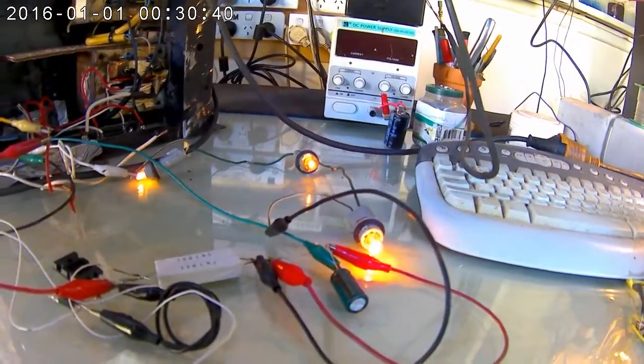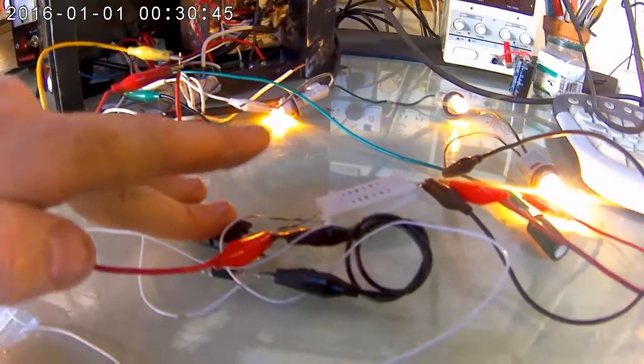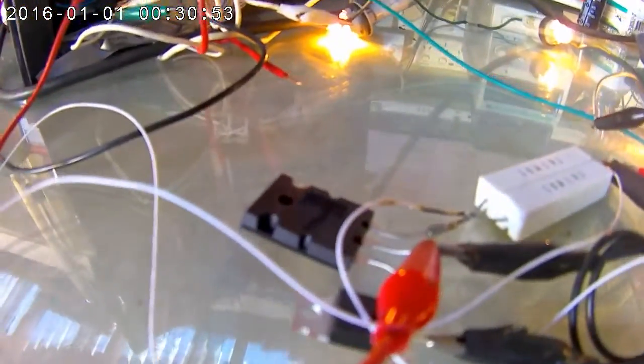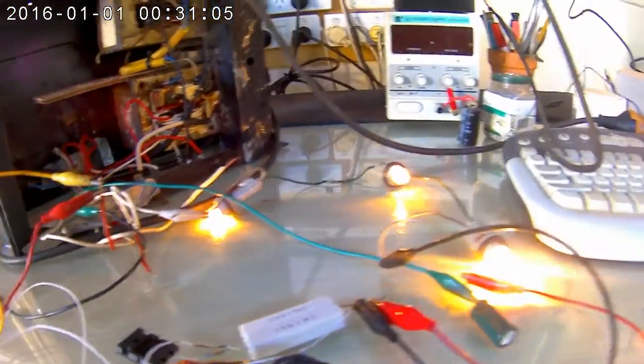And that's the voltage limiter over there. The transistor is getting a little warm — probably 60 degrees — but as you can see there's very little load on it. These transistors are good for a short circuit current of about 20 amps, and naturally there will be two of them. I'm looking at a total output of about 70 volts and it will take 15 amps, so it should do the job nicely to charge the electric bike.